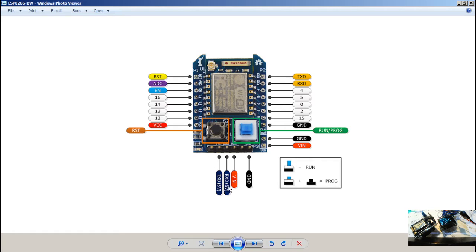You can use TX, RX, and this is 5V, as you can see. This is a good board to use as a USB TTL at 5V. Underneath this board there is the regulator for 3.3V. So this is the V-in, which is 5V, and you can connect it to other components like another modem. And this one is 3.3V, which is what this board is running on.